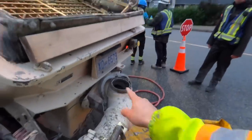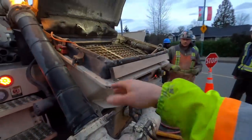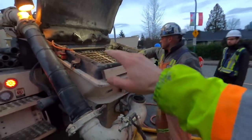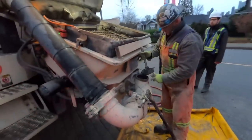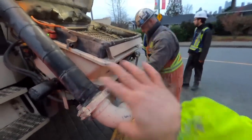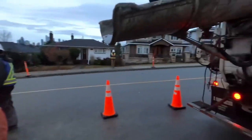Important note: once you've got your bentonite in, no stroking of the pump until the hopper is full of concrete. Otherwise when that tube shifts over, your bentonite is going to spill back into the hopper. So once you've got your goo in there, leave it alone until you've got concrete.